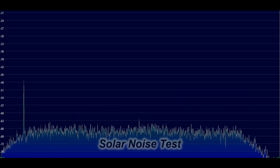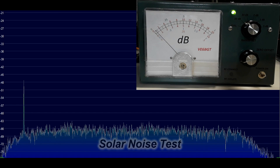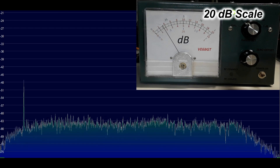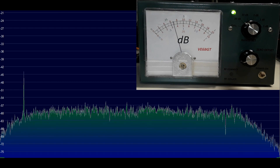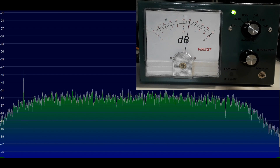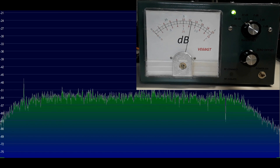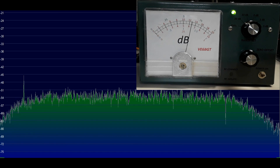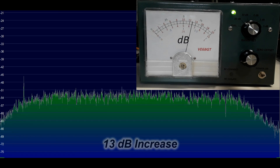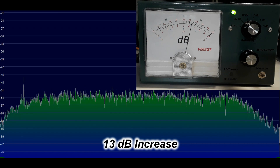I got back in the shack, and one thing I don't think I've ever done, or recorded anyways, was do a solar test just to see what kind of an increase I get off the cold skies, so that was the next thing I did with this setup. I moved the drives back and forth a little bit, but it was about as good as I got. It was 13 dB over the cold skies, so I'm not sure if that's very good or not. I'll have to look into that.